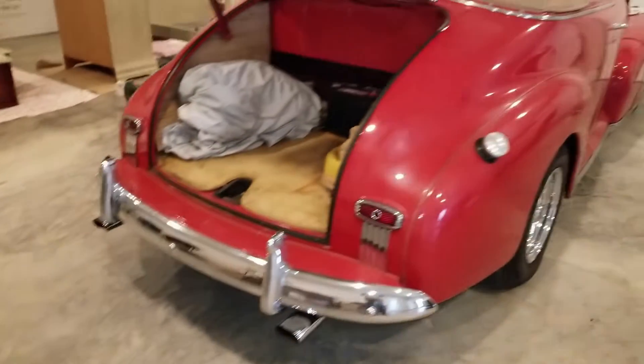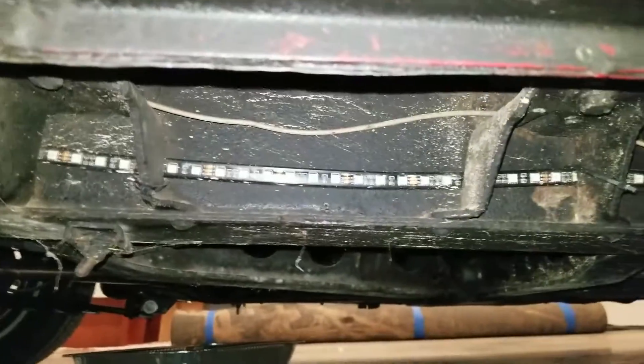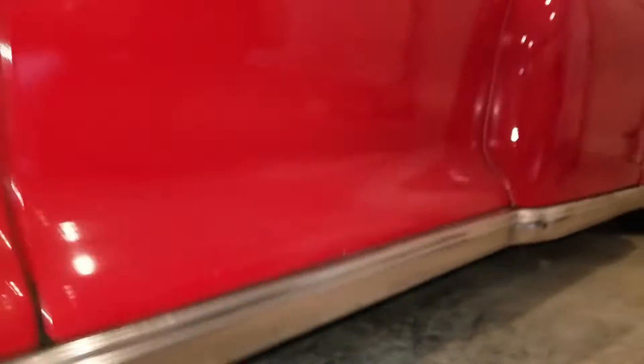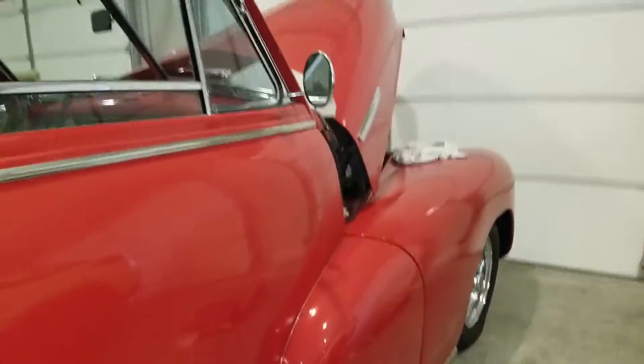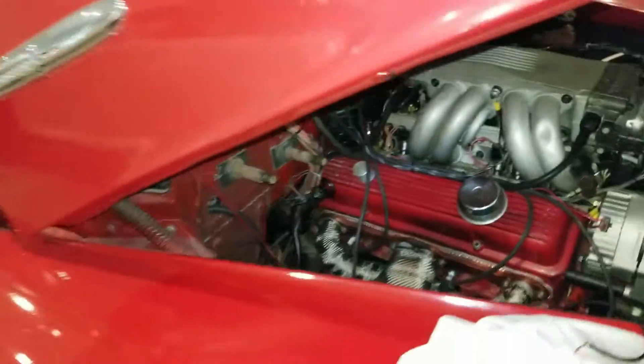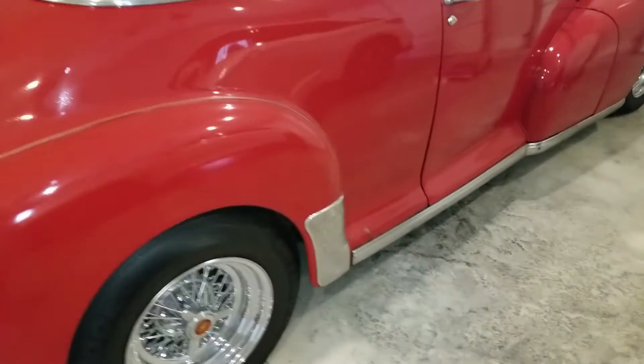Here's the issue that I have. I have this 47 Chevy that I have LED light strips ran underneath. They're up and under the car here — you can see where I've routed them along the chassis here, on both sides. I had this thing wired up to the front where the 12-volt battery was. Here's the converter box — it runs off 12 volts. And this is where my battery used to sit. Now we did some changes and moved the battery to the trunk, so the 12-volt battery is now sitting in the trunk, which posed an issue of how I was going to power the lights.